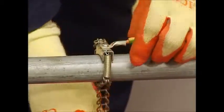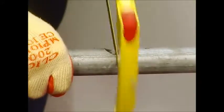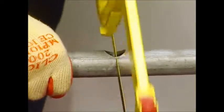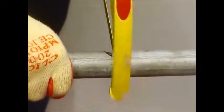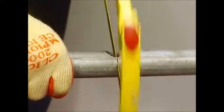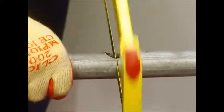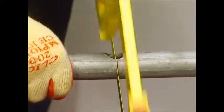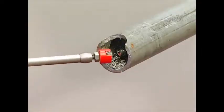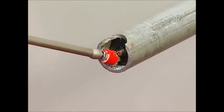The pipe may be cut through the drilling hole. However, you may wish to check where the stopper is in the service using the spring and cut accordingly, making sure the hacksaw does not interfere with the stopper. The nearer the stopper is to the cut, the easier it will be to retrieve it later. If necessary, get rid of any swarf with the magnet.